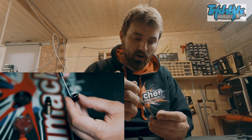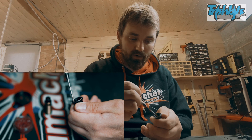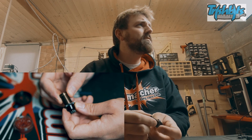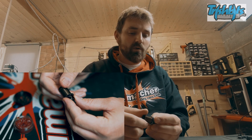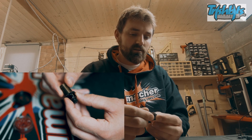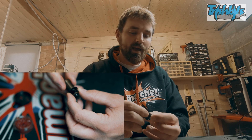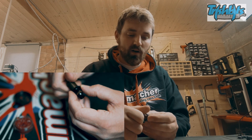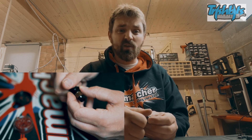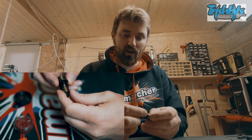I'll drop a little bit of o-ring grease on the o-ring because when I put it on the body it means there'll be no frictional drag from the nitrile o-ring, and it will just slide on nicely. I push it on backwards until it pops onto the o-ring, then it finds the thread - there's a little click - and then I start turning the normal way to meet the thread. I do this a lot when assembling things - find the first thread instead of just cranking on it, because you'll end up cross threading, and cross threading is not great.